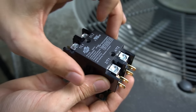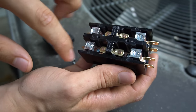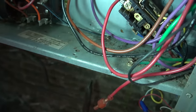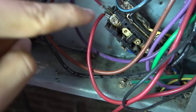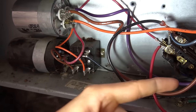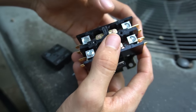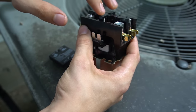Even on the new ones, you can take off the two screws, the cover comes off, and here you can see the two plungers. There are two different kinds of contactors: the two-pole, which has two brakes and two plungers, or ones like mine that residential air conditioners typically have — just one pole, meaning it only has one plunger and the second leg is always connected. Right now I actually have voltage at my capacitor — 120 volts — so you don't want to be prodding anything even if the plunger is out. Before touching any wires or connectors, make sure you verify that the power is off.